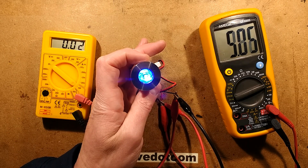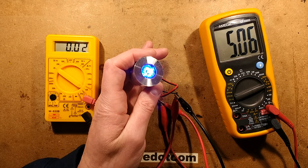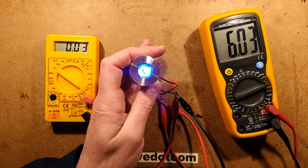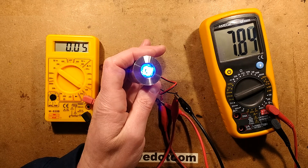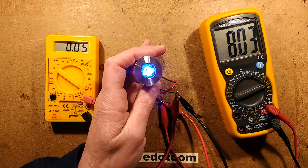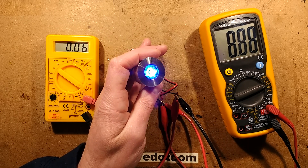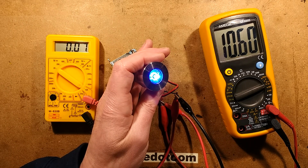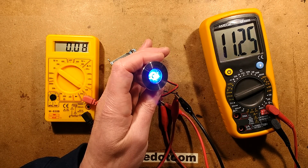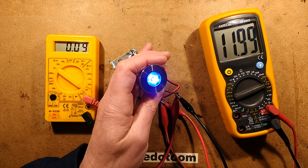Let's push it up to 5 volts — this isn't reading much because I'm only getting 24 milliamps in the bench meter, and it's progressively rising as I turn the voltage up. There's no self-regulation. At this point I would have expected the LED to be drawing a full 1 watt if it had active circuitry. But the way the current's climbing as I turn the voltage up... approaching 12 volts now and the current is 90 milliamps, and that rose so linearly.